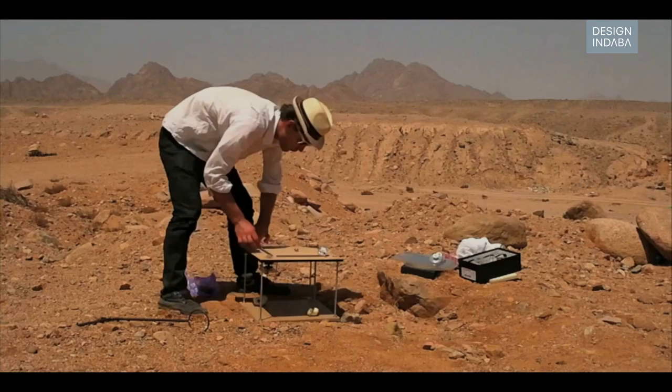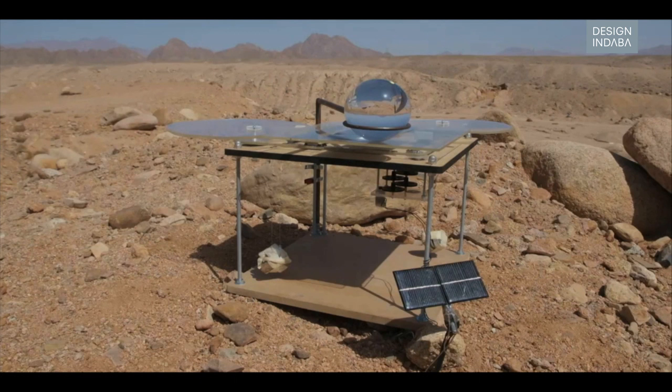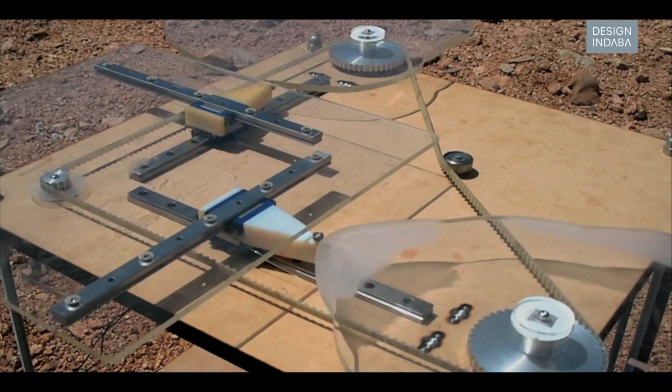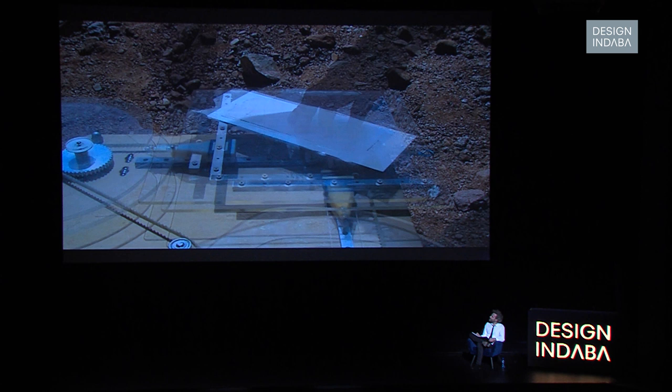The machine was an exploration into 1800s machinery, which heavily relied on cam systems. Cams were used to create repeated motion or actuation, and some of the finest watchmakers of that time made incredible puppets that could write poems or draw pictures purely by mechanical means, having pre-digital hard drives made of complex cams driving the motion. In my design, there were only two cams — one for the x-axis and one for the y-axis — mechanically driving a platform below the spherical lens. The simplicity here was key, as the machine got away without much electricity. Only a small solar cell provided electricity for an even smaller DC motor driving both cams.